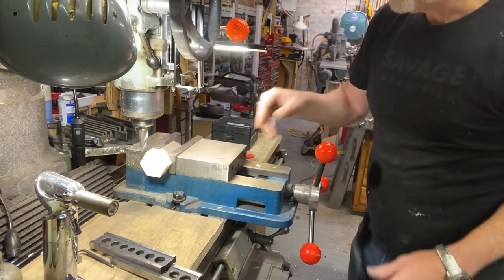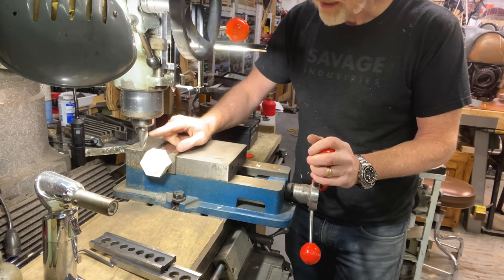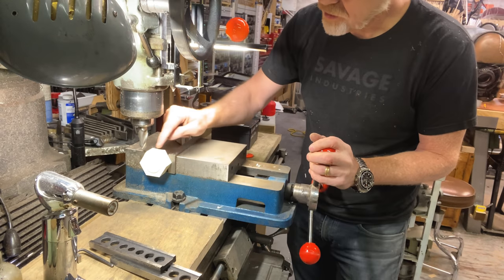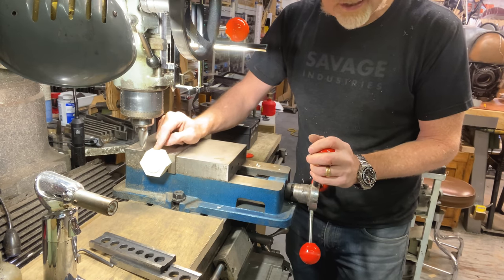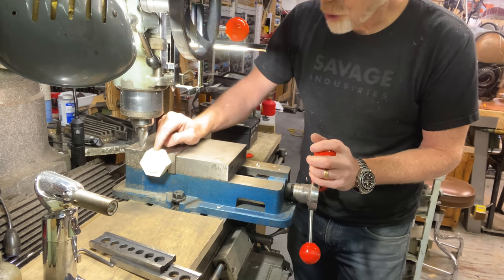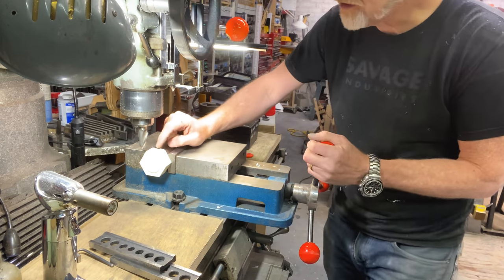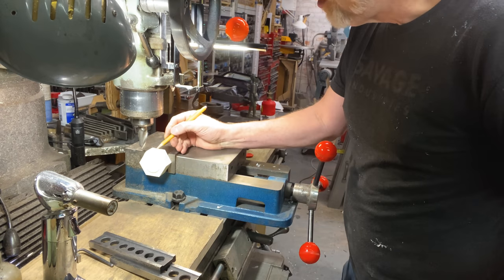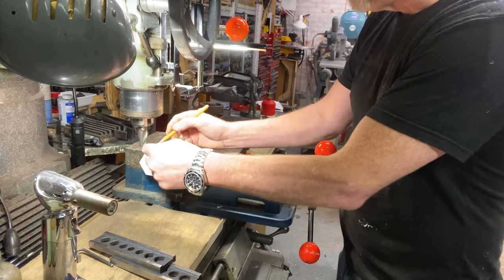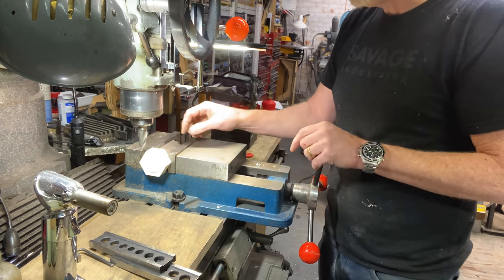Okay, so now what I want to do is add a tightening screw that will allow me to tighten this against the motor. The motor has a flat milled on its shaft, so I'm going to do probably a 10-24. You want coarse threads with soft material, so 24 threads per inch is better than 32 threads per inch. I also am going to be putting a hole in the center of each of these faces to receive the magneto wound part that we'll make in a few minutes.